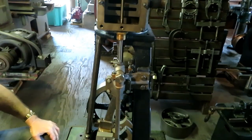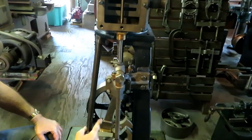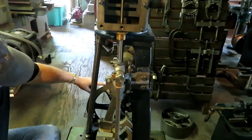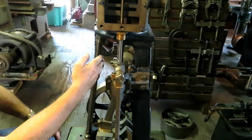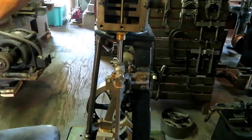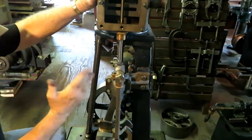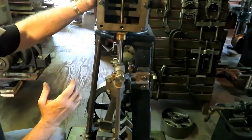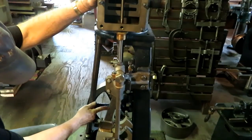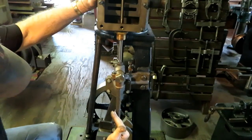There's two ways of measuring what's going on with the different events here. There's flywheel rotation, which is degrees of rotation of the flywheel, and then there is the stroke, which would deal in the percentage of the stroke one way or the other. In this case, it's 6 inches, and those things do not agree with each other on steam engines. Some engine designs are worse than others, but here's the culprit right here. It's called rod angularity, because the rod is off to the side halfway through its stroke.